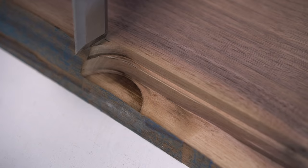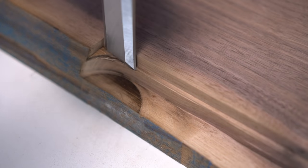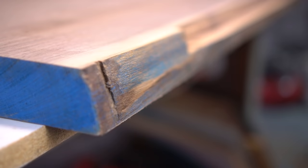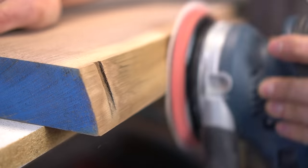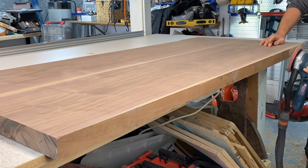I have a router sled table, and that's how I did it — let me know in the comments how you would approach it. To get a nice square edge on both sides, I took a sharp chisel and chiseled away all the excess in both corners. Then I decided to start sanding. You don't have to sand the whole thing yet, but make sure you sand at least the side where you're going to pour the epoxy, because once epoxy is there, you won't be getting to those edges anytime soon.